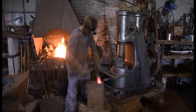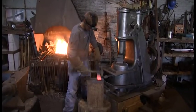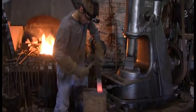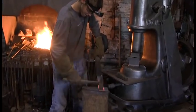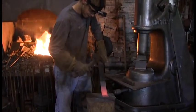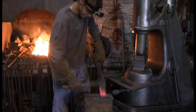We can see that he's gripping the hammer tightly, absorbing all the shock and stifling the rebound. The hammer is only arcing 10 inches, its velocity is retarded. If you look closely, he is also hitting way back from the edge. Almost nothing is being accomplished. But what we see is only part of the problem.